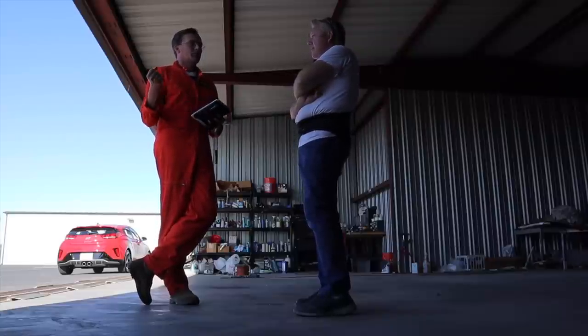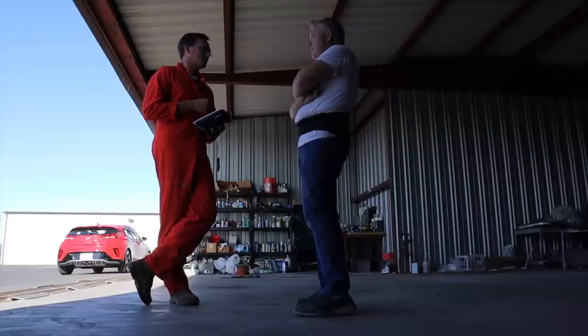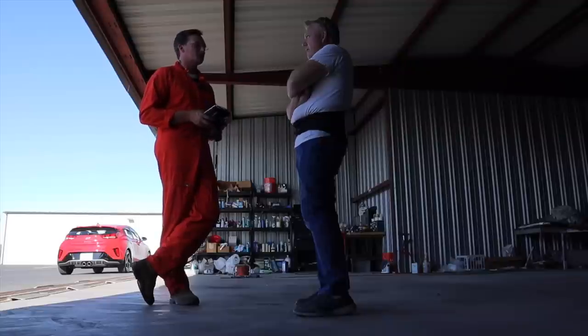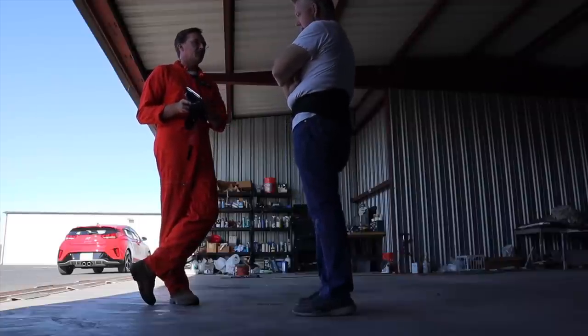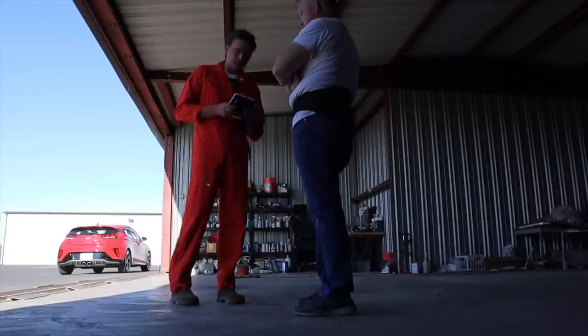Roll right wasn't as powerful as roll left. It was a little bit weird, sort of noticeable. Plenty of dihedral effect as expected. Didn't go any slower than 80. I could feel that I wasn't far from the stall at that point, so knock it off. That's 80 indicated, but our predicted clean stall is 77. Right, with the 10% error, so we should be pretty close. So that all sort of jives.